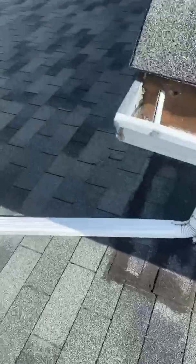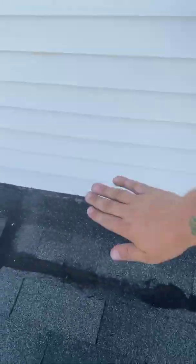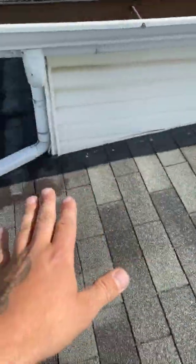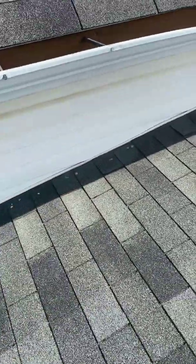But there's base flashing here. Where does base flashing go? Base flashing goes on the base of a house. So if the wall meets a roof that slopes away from it, you put base flashing. If your roof is sloping not parallel with the roof line or the wall line, then you put step flashing.